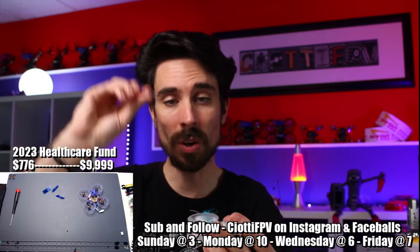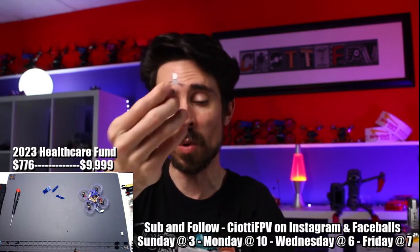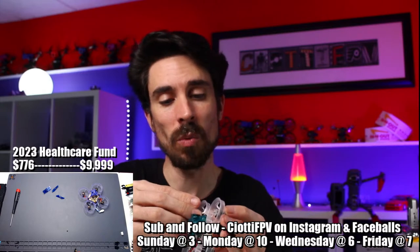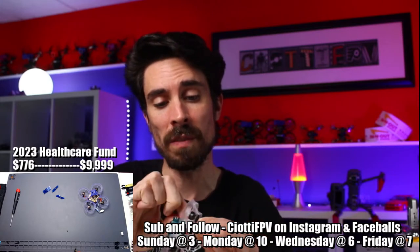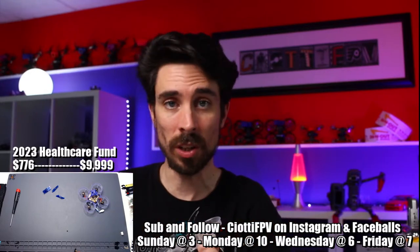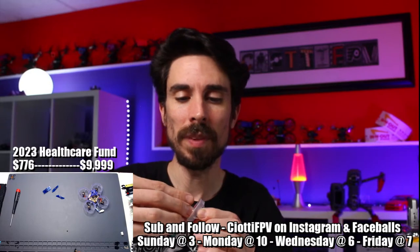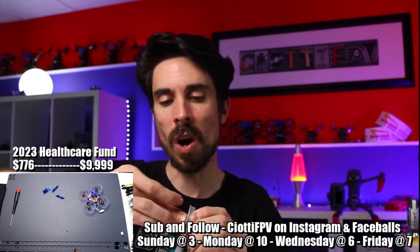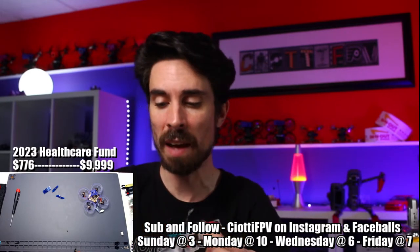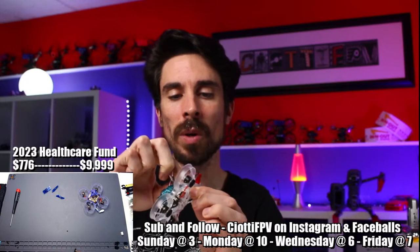but I still want to do it. So we're going to put on the best tri-blades that there are at the moment, which are the GemFan 1208s. And I'm going to put them on props in. And we're leaving the Hummingbird 0802 25,000 kV motors. These propellers almost certainly will not perform as well because they're a little bit heavier. The reason that they're heavier is because they're significantly stronger. These propellers are strong enough. They're the right strength, in my opinion. They're not too strong and overly heavy, but they're strong enough where you can put them on, take them off, without ruining them.